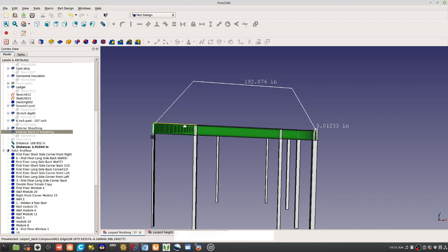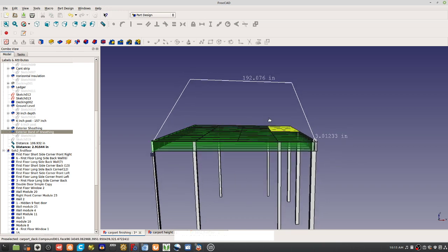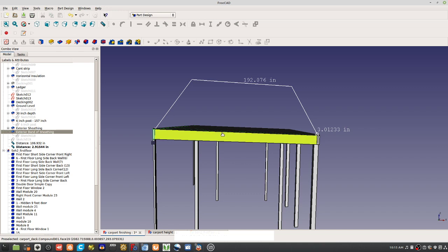We could take a long beam, put it across here, and put a level on top of it. And if it's level, and there would be a 4-inch drop here, then that's where we're good. But we have to have a 16-foot piece of material to lay across the joist here. So probably the easiest is the laser level, though it's kind of tricky to see the mark in the daytime, but I think we can see it.